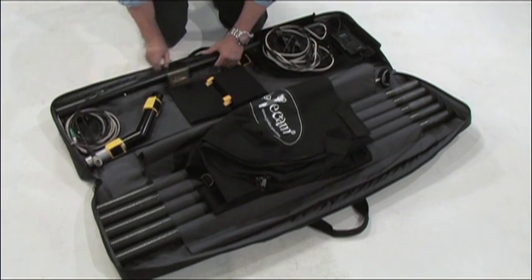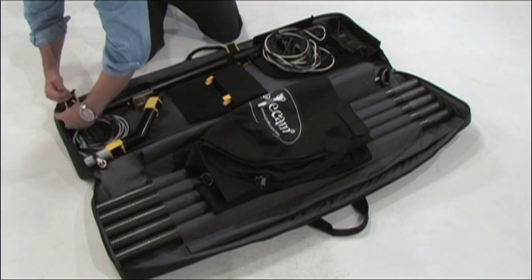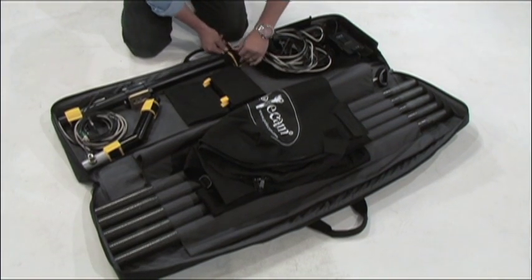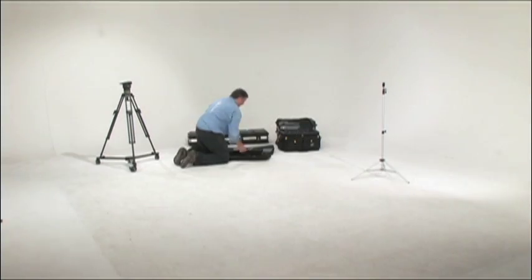It is also a good idea to release the mounting plate and slide it to a place along the boom section of section 1 where it cannot damage the cables. Use the harness covers to protect the cable ends by putting them into strategic positions and make the system ready for transport. Don't forget the rigging stands.